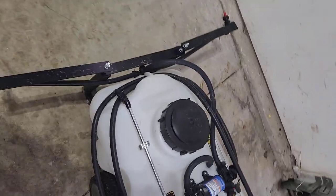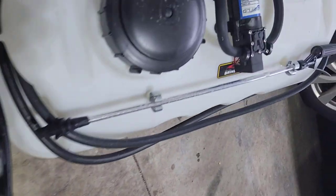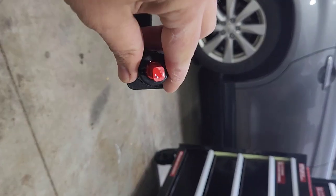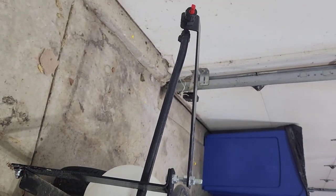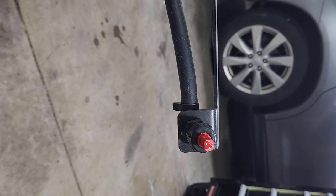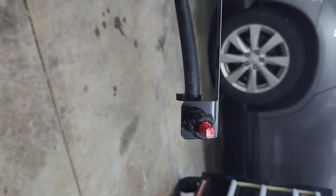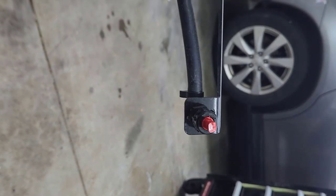One thing I'll mention before we look at the harness attachment on the actual tractor is, let me flip this back over for you guys again. I wanted to make a note about these nozzles. I'm really heavy-handed, okay? And I actually broke one of these by over-tightening it. These are plastic. I forget which one, but I broke one and had to order, I think it was 10 bucks online, a little set of these plastic nuts. It also came with these additional nozzles. So don't do that. Be really gentle with these right here, because like I said, I actually broke one of those.